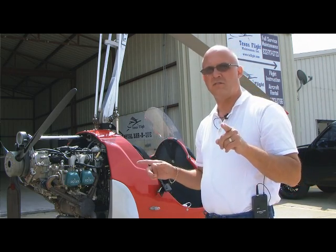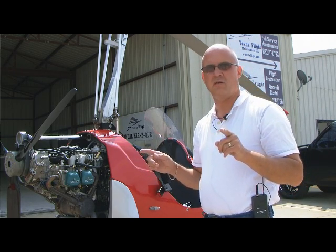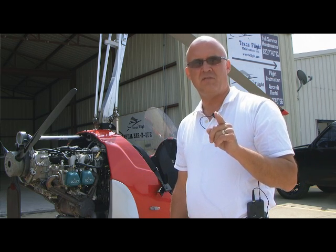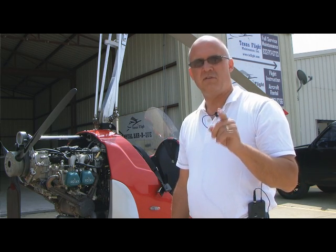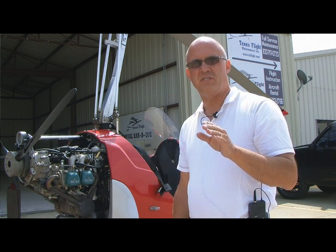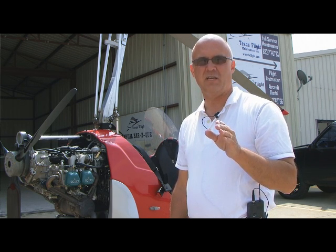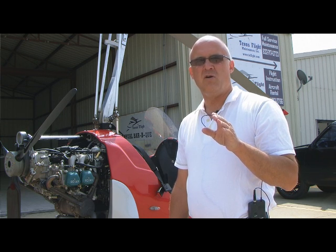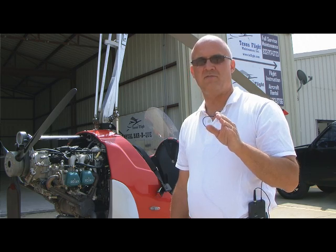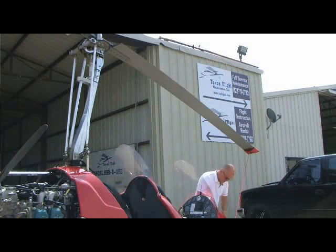Next, we're going to look at the controlling surfaces of the aircraft to make sure that they're in operational condition and they don't have any problems with them. This includes inspecting the rotor and cleaning it, because even if there's debris on the rotor and it doesn't have any problems, it can still reduce lift up to 30%, just like frost on the wing of an airplane can. So bugs and debris or frost can also cause problems with lift on a rotor as well as fixed wing planes.